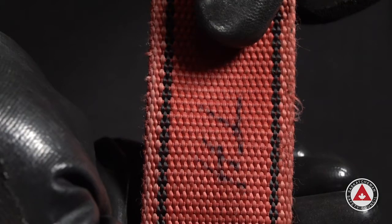Also, feeling the webbing — it's not just a visual inspection. We're feeling it to make sure the webbing isn't stiff from chemical damage or from high heat damage. Once webbing becomes stiff, it's becoming brittle and it's not as strong as it used to be. Somebody wrote on the webbing in this case — we recommend that you do not write on any form of webbing. The manufacturers will allow you to use specific brands of marker, but it's still not a recommended practice.